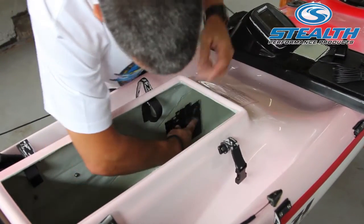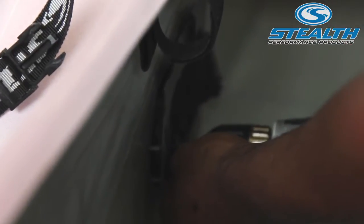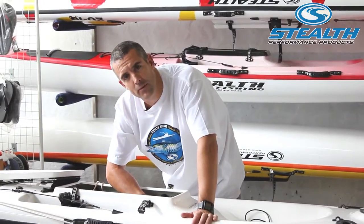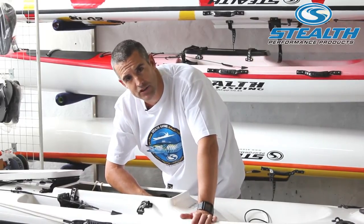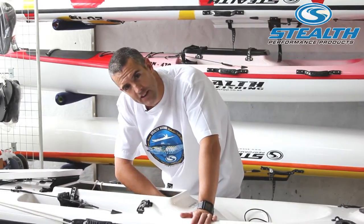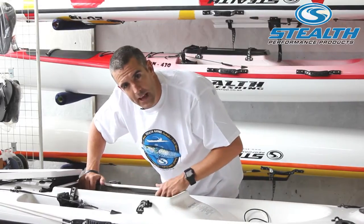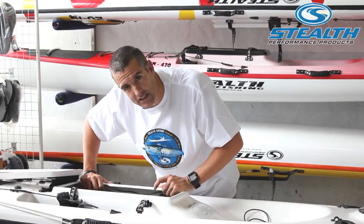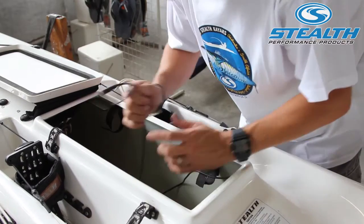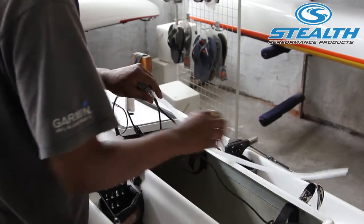When you screw your battery box in, use a screwdriver very slowly or a battery drill also on very slow so that you don't tear the fiberglass. Screw it in very gently until it is secure. Now that we have fitted the battery box and glued in the transducer and allowed the epoxy to dry, you run the transducer cable through the top of the battery box where there is a little slot or hole for it to go. We will now spiral bind or connect up the cables neatly into the fish hatch of the kayak so they don't get in the way while you are fishing. On some units you have a separate power cable from the transducer cable, so we will spiral bind the two cables neatly together.